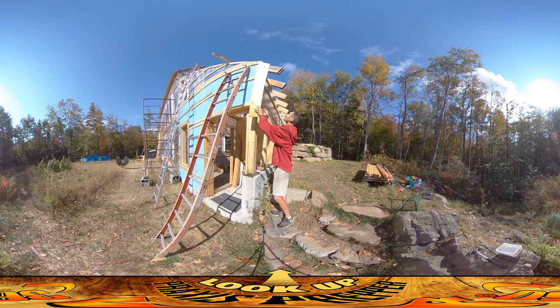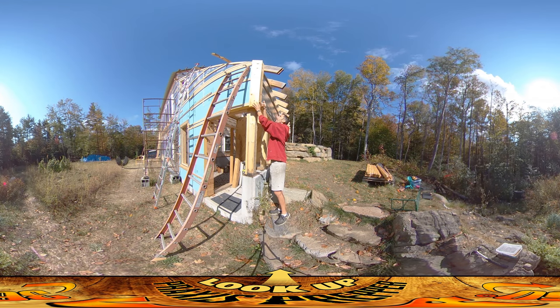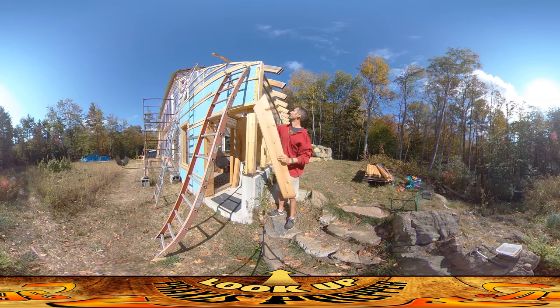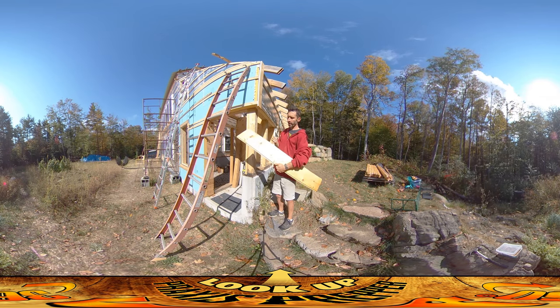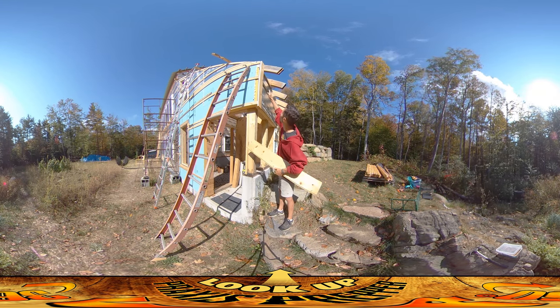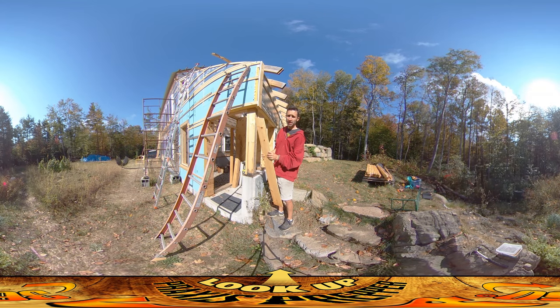This board is going to be the first one that goes up right here. I'm going to screw it up here and make a mark on the back side, because while you hope this is a nice flat surface, if there's any kind of a curve to it you want it to get matched in the board. I noticed there's a little bit of a bowing out up at the top, and I want to make sure I cut this with the same kind of bow so it'll just match and be a nice square corner.